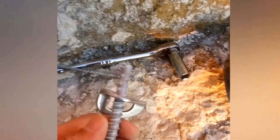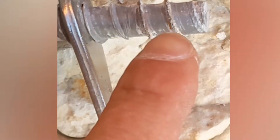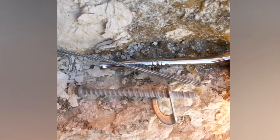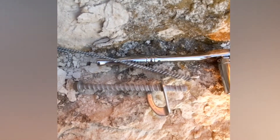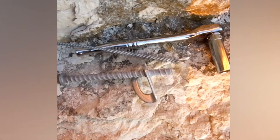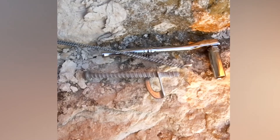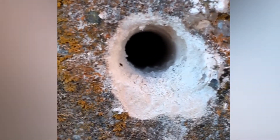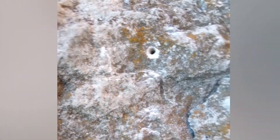I don't know if you can see in the video here — basically those last couple of threads have started to corrode a little bit due to bimetallic corrosion, since those last two threads are not stainless steel. They're the sacrificial threads, which are starting to rust a little bit over nine months. I've placed several of these bolts out here on short walls where personally I don't think they're likely to put people at death risk. Not very many people climb out here, but there have definitely been a few that my friends and I have taken pretty hard falls on repeatedly that are still holding up pretty tight. I'm interested to see over time — come back next year and the year after — and see how long these take to start to degrade and if they ever loosen up. Some of this rock here is pretty soft limestone, so I wouldn't bolt into something like this, but something a little bit harder like where that hole came from — you can see inside the hole it's cut in pretty good. I'll go ahead and replace this bolt with a glue-in just to match this other bolt next to it and provide a super solid belay station for this beautiful area.